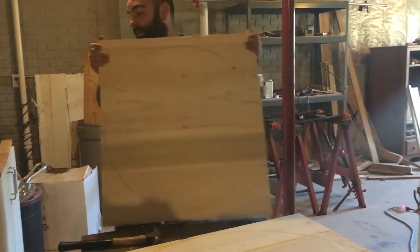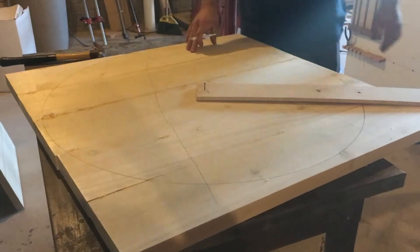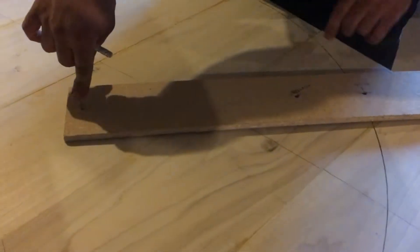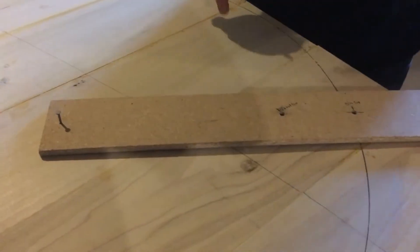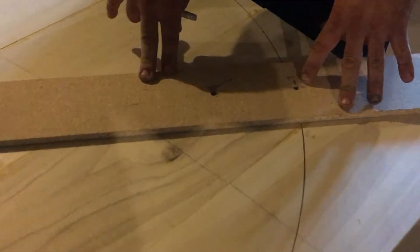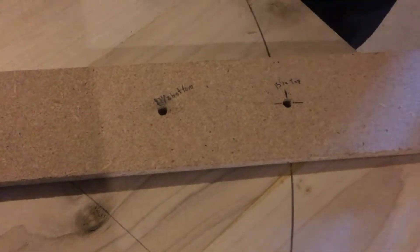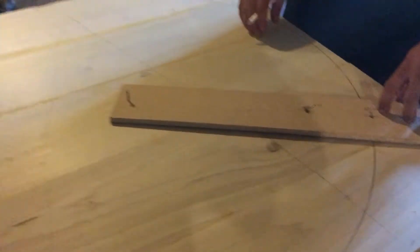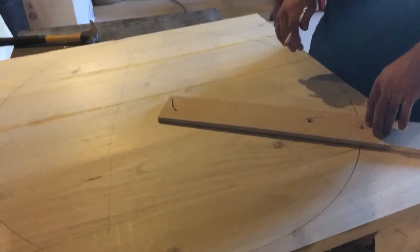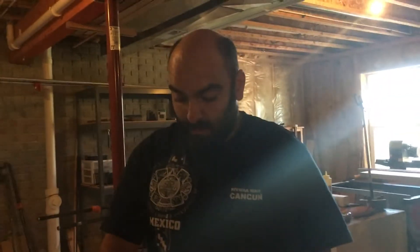If we pan down, I'll show you the system we used to do it. Very simply, I've edge glued up a round table top and then I find my center and I put a nail through a piece of — this is just old shelving off of a metal shelf, very easy to come by — just a strip of like pressed wood. You can make this out of plywood if you want to use it multiple times. I don't really have repetitive jobs where I keep doing different sizes of circles, so I like to make them one time use.